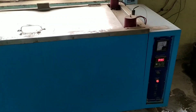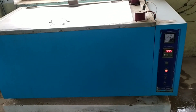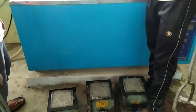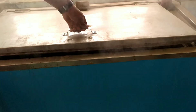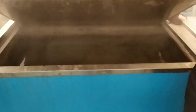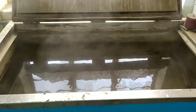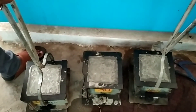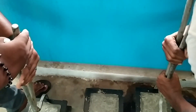After reaching 100 degrees Celsius, we need to remove the top door in order to keep the standard cubes for accelerated curing. We remove the top plate slowly. The water temperature is now 100 degrees Celsius. With the help of a plunger, we place the specimens one by one into the accelerated curing tank, slowly holding the three cubes in hot water at about 100 degrees Celsius.